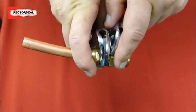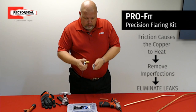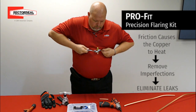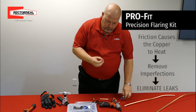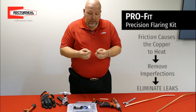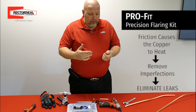And of course, you're supposed to use the appropriate torque wrench to the torque settings of the manufacturer's instructions. Now let's pull it back. Let me verify that I tightened it. Now let's open it back up, and we will actually see that we have formed our flare perfectly to the male portion of the fitting. It's already been preheated, pre-expanded. So now we go into heating mode. We've burnished it. We've eliminated a lot of the imperfections.